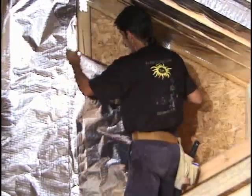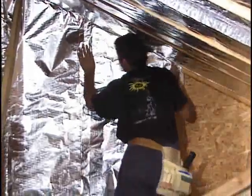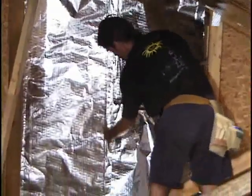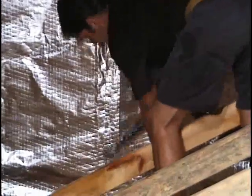In addition to truss installation, radiant barriers are often installed in gables. The installer works his way upward, attaching the barrier to the studs using one of the previously mentioned methods. At the taper of the roof line, the barrier is cut or folded to match the angle, and is then stapled into place.